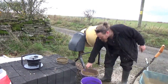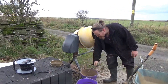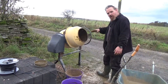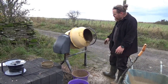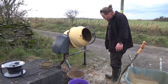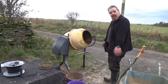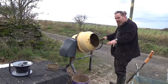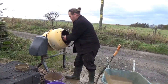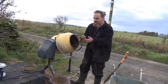That's about two thirds of a bucket there. I want to go a little bit at a time — I've got more clay but I'd rather just make this batch and see how we go. You can see it's a really fast way of processing clay in bulk. At this stage we can even make this in large batches and set it aside and come back to it in a couple of weeks, but once we put the straw or fibre components in, that can rot if it's left wet — but it's not an issue at this stage. And that's another benefit — I wouldn't be doing this with my bare hands with a cement-based mortar; it's really quite unpleasant for the skin.